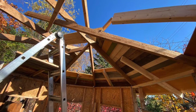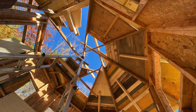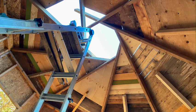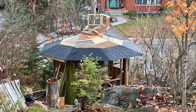This is built with pressure treated 2x4 boards. The previous flat roof was 2x10s, probably 10 or 12 inches apart, so basically indestructible. So it's going to be really interesting to see how well this roof holds up. And I've purposely used small, inexpensive lumber, just to see how well it would work. Now it has already gone through one winter with an exceptional amount of wet snow load twice during the winter, and it held up just fine.